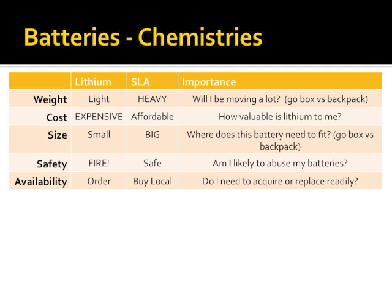Safety: lithium batteries, lithium ion, lithium polymer, could be fire risks. Overdischarge them, puncture them, expose them to air, they could be fire risks. Lithium iron phosphate are safe though. Sealed lead acid, relatively safe. Availability: for the types of packs that we need, there's a Batteries Plus across the parking lot from Atlantis. You all can go buy AGM batteries. The lithium packs we need generally are going to require being ordered.